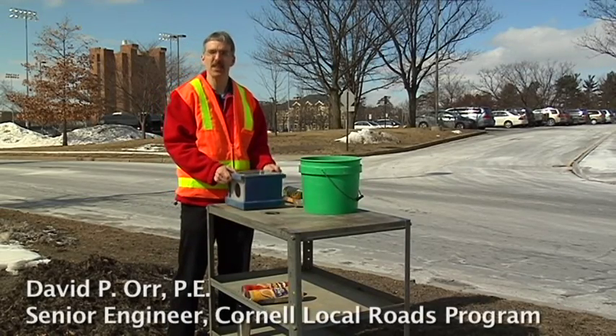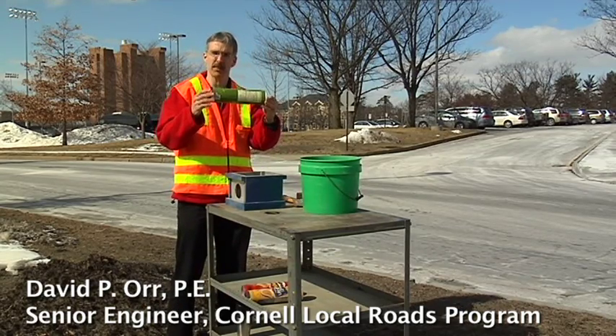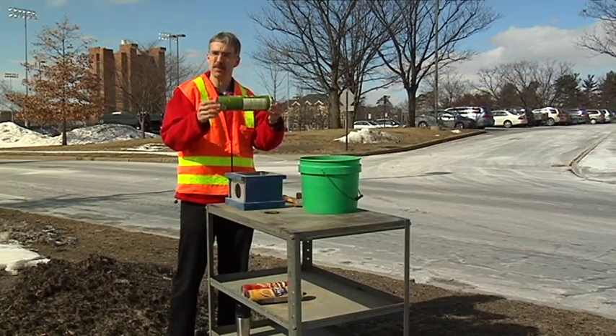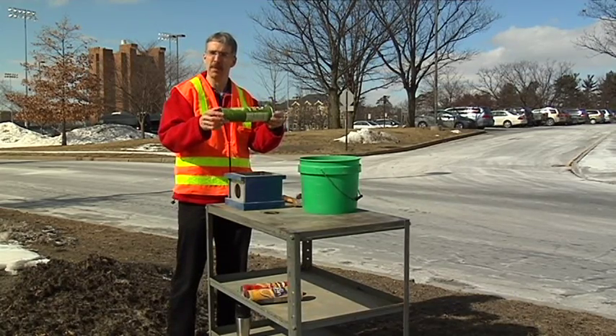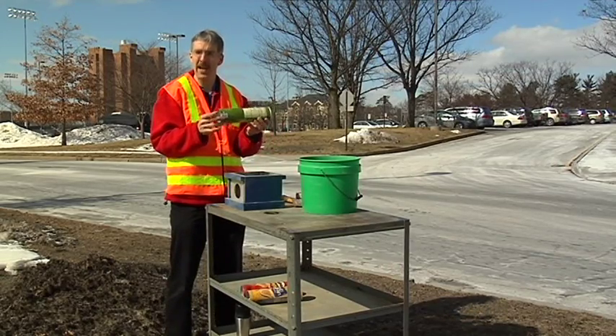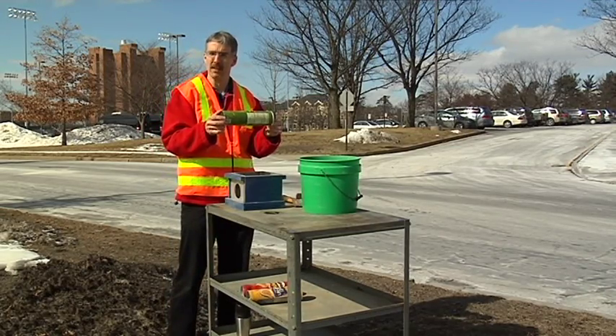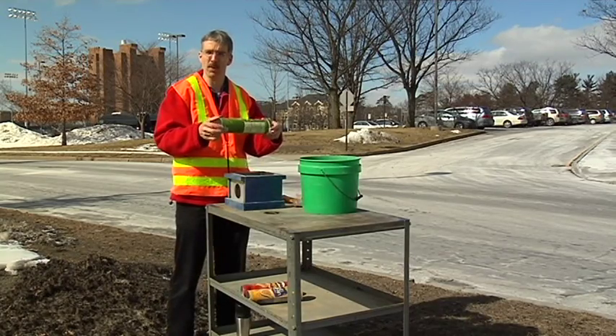In this demonstration we're actually going to build a culvert pipe out of a can of potato chips. This can of potato chips is an awful lot like flexible culvert pipes made of plastic or corrugated metals. Obviously not strong enough to support my weight, but if we backfill them properly, it will support my weight — the same way that a culvert pipe will support the weight of a dump truck.